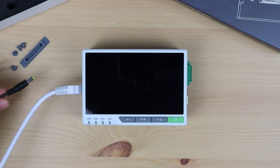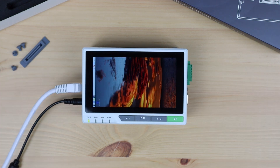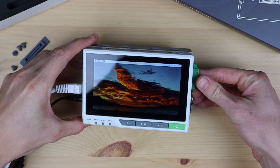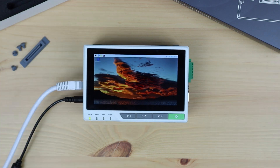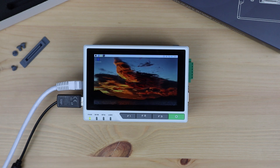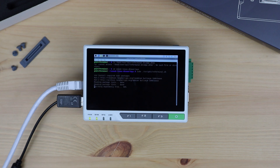Let's plug in our Ethernet and power cable and power it up. It looks like it worked right away — the reTerminal powered up and booted to the desktop. There is a driver that needs to be installed to use the functions of the E10-1. I reloaded the operating system on my reTerminal to get Raspberry Pi OS Bullseye loaded, and part of this process is installation of the latest reTerminal driver, which looks like it includes the E10-1 drivers as well. I haven't specifically installed any E10-1 drivers and as far as I can tell, everything I've tried works correctly, though I haven't tested the industrial interfaces yet.